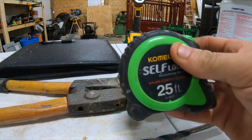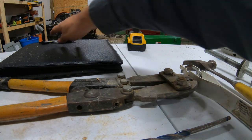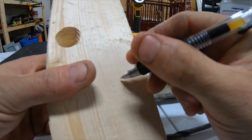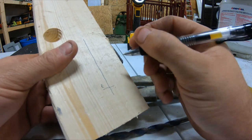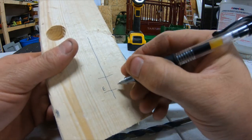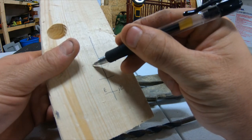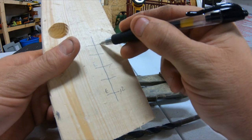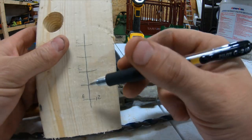First off, you're going to need a tape line. What you'll do is measure your distance of wire spacing, and once you get that, I made a stick — and a good idea is to mark it. Let's pretend this is your stick, it's four foot. You'll have your line space, then I put an 'E' for electric and then a normal strand — I think I ran that one 12 inches. Electric wire and electric on the top, so that allows you to know that you're going to need an insulator.